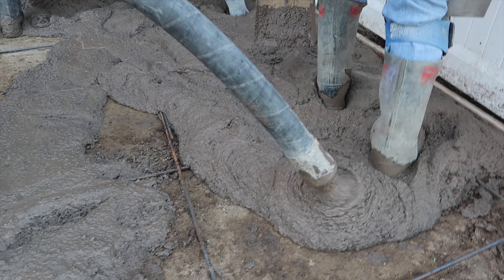We have a minimal joint pattern here, but what I also do on these joints — when I come in to do the cleanup — I'll drop off the corners on each end. I'll drop a concrete cutoff saw and really deepen these, so I can assure that it will crack on those locations.